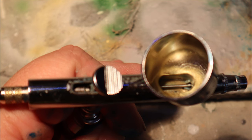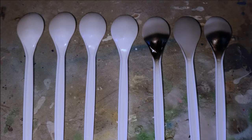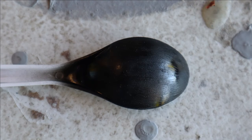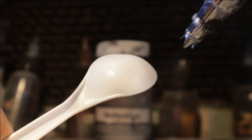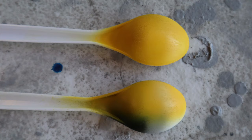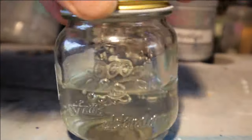With different base colors produced using different pigment materials, depending on the quality of the paint and pigment density, the behavior and opacity of the paint can differ. We'll be doing a pigment test on some spoons. Black reflects the least amount of light and has the easiest and best coverage. White reflects the most amount of light and uses a very expensive pigment — titanium. Spraying over different undercoats results in different light reflection and how bright and vibrant the paint may be. Yellow is also notoriously hard, just like blue. All of these have been diluted with standard thinner at a ratio of one-to-three; over-dilution can result in more coats required or poor coverage.